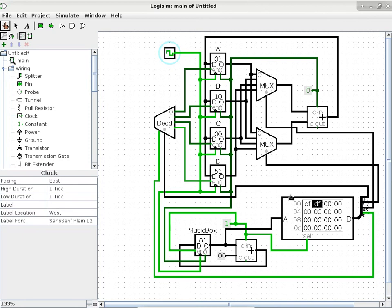But this time, let's talk about a very simple mux because we are talking about a single select bit. There's one single select bit here, which is the borrow out from a subtractor. So now you can say one alternative is here, one alternative is here, and this is the output. One can specify a specific location that you want to continue to execute, and the other one specifies just the next location based on the adder. So that will give you the most basic mechanism to do something that is conditional after a subtraction.